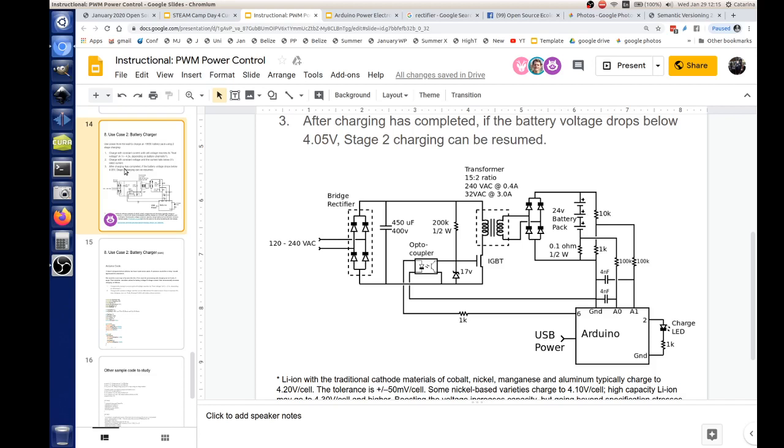Right? So that's what we're saying, is we just charge all our batteries. So all our batteries are already at 100%. But let's say you put them all in parallel, and let's say you just force another 1 amp through all of the batteries. If you go and measure it one battery at a time, you're going to find out that one of the batteries is taking the bulk of all that 1 amp, and the rest of them are maybe just trickling. And that's just a problem with batteries when you put them in parallel. And that's whether they charge or discharge. They do the same thing. Okay, so that's the charge condition. That's fine. So yeah, one gets a lot of it.